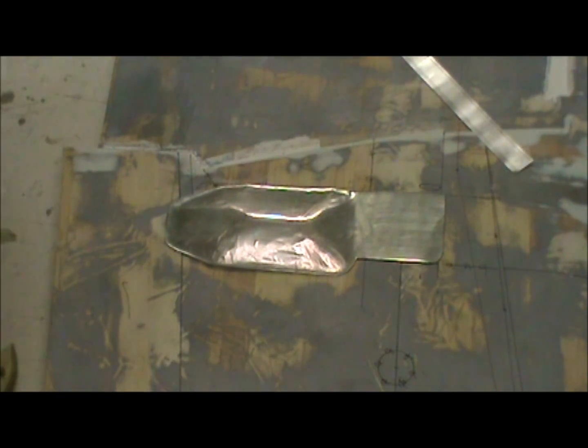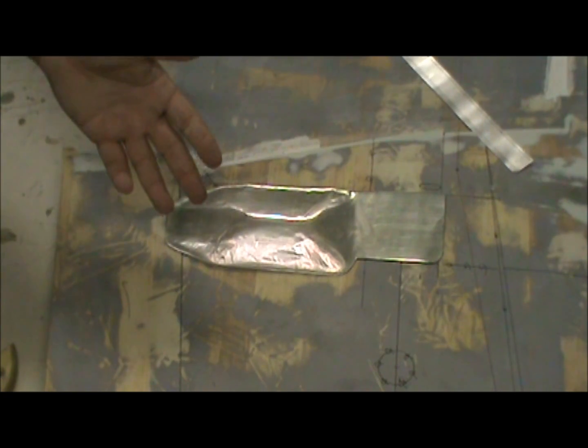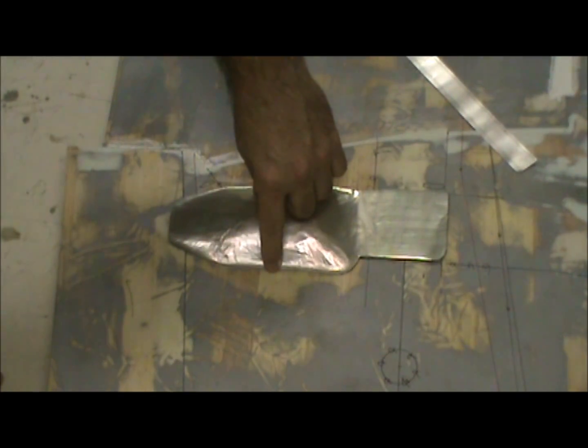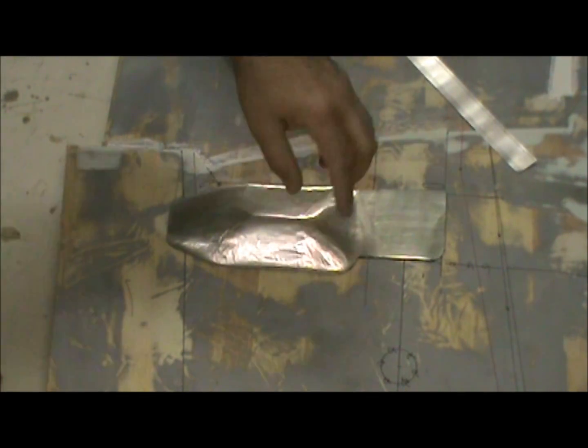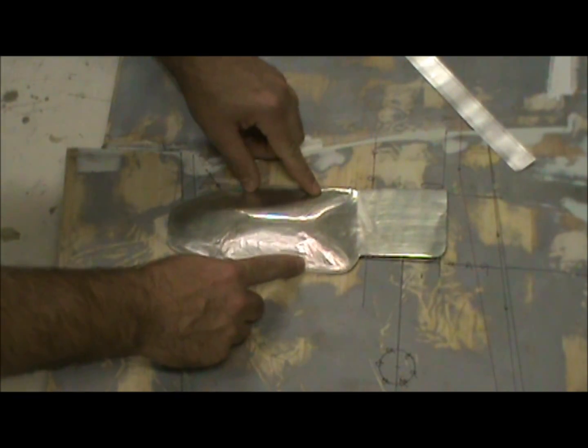So say if you're making a 90-degree bend, you actually have to bend it over like 91.3 degrees or 92 degrees. That way when it springs back, you get your 90 degrees. Since we can't work it any more than the angle we want, it's going to spring back to where it doesn't quite fit as tight.